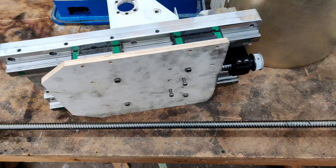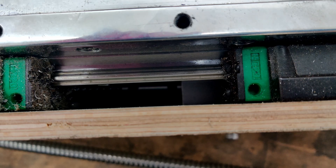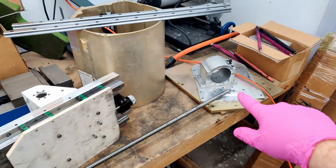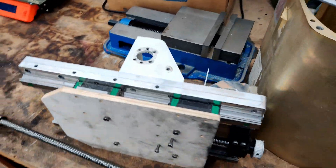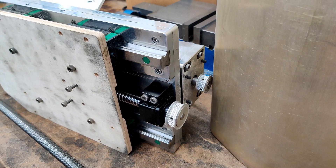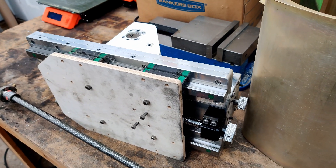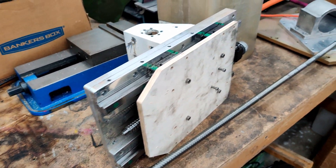The DFU ball screw for the Z-axis is on there - you won't be able to see it in there. I have a wooden plate on there to allow me to put the pocket onto the aluminum plate. A roadblock I ran into is that the bigger BK block pushes everything out a bunch, and the timing belt I use is too small for this new setup, so I have one on order arriving in probably two weeks.